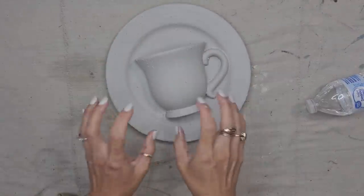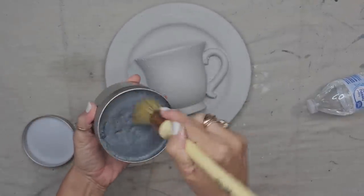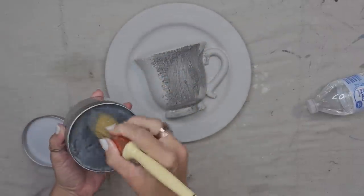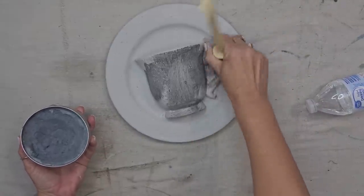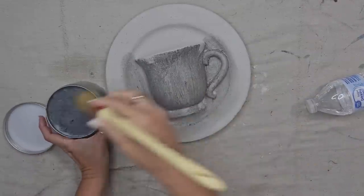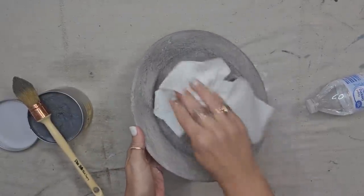You could leave it like this, but I really want to add some more dimension and really have the texture stand out. So I'm going to be using Dixie Belle's Grey Grunge Wax. I'm a little bit obsessed with this right now — I just love the way everything comes out that I put this wax on. I'm using the Dixie Belle French tip paintbrush; it's my favorite for waxes. It has a pointed tip just like the sash brush, so it's great to get into all the little details. I'm just going to put the Grey Grunge on my entire piece, and then I'm going to take a dry paper towel and wipe the excess off.